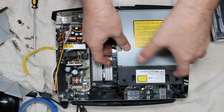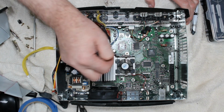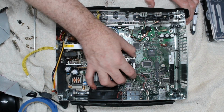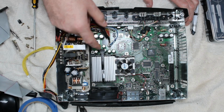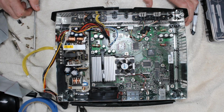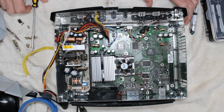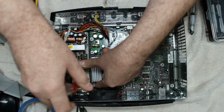All right, let's open this up. See what we're working with here. Looks good. Clock cap's already been removed. Fan's decent, but we're gonna replace that, redo the thermal paste underneath. CPU fan moves, so it's not making a good connection anymore. We're going to take that off, clean that, remove the paste on that, and reapply new. Power supply looks very clean. No visible issues with the power supply. No bulging caps on the board. Looks like a nice candidate to get modded in. I think we can do something really fun with this one.